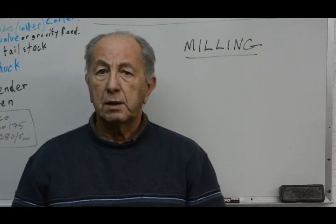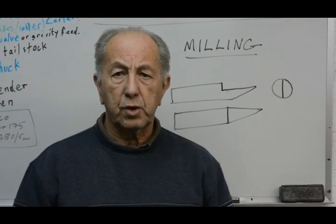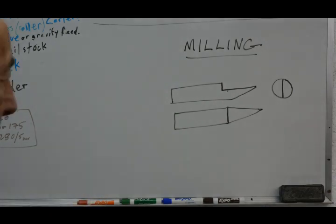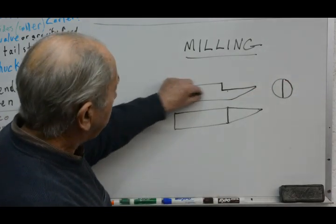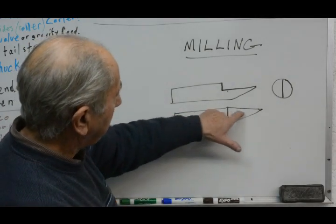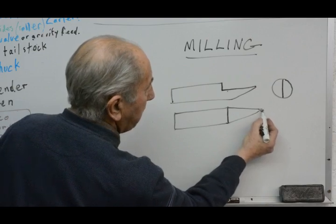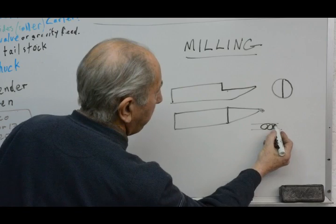If you see part one of the video, you will see how I actually checked to see how flat it was. To mill away the isolation tracks, it's pretty obvious that because we want those to be very narrow, we have to have a very small tool. I use cutting tools like this which are known as a D cutter. That's because if we look at the end of it, the solid part looks like a D — the round shank is cut away so it's flat approximately halfway through. Looking at it from the other view, it comes to a point which is a little bit off centre, so that when it rotates it actually cuts a fine groove. The point comes around and as it moves along it cuts the track.